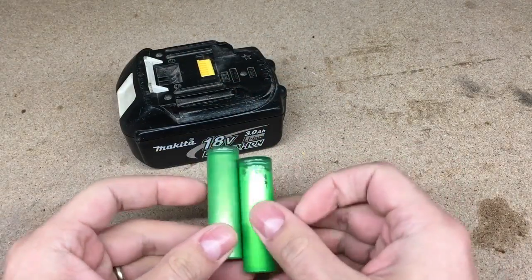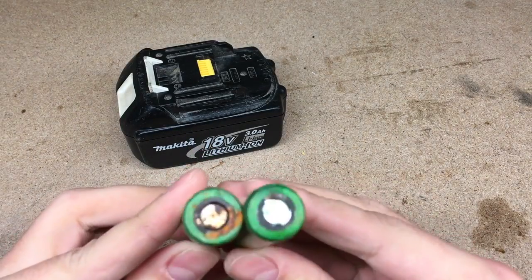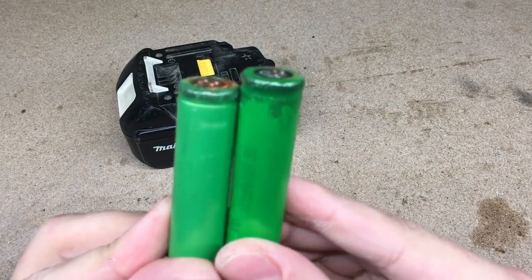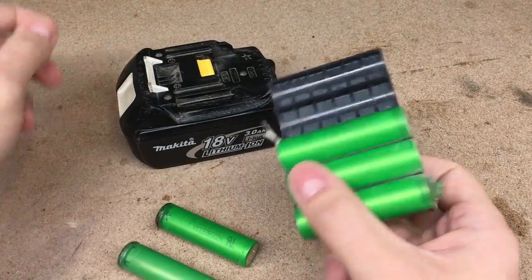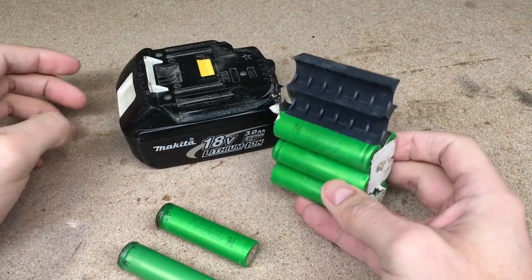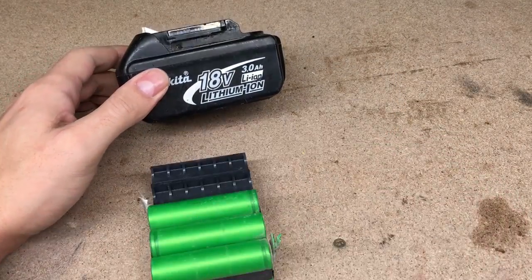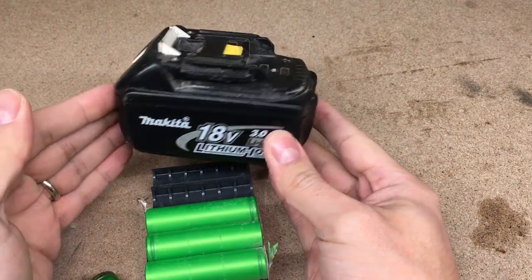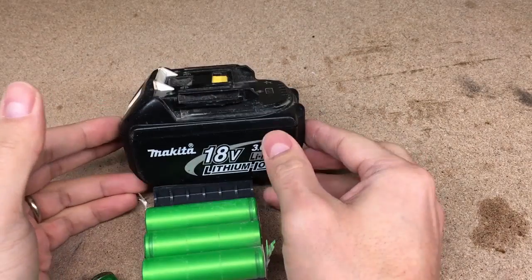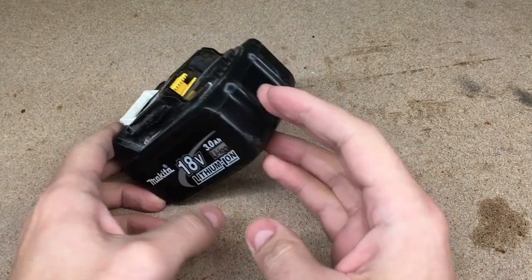In the beginning, I had two dead and useless batteries. By taking out only two dead cells and replacing them with a pair of good cells from a donor, I got one full operating battery and six 18650 cells for future projects. This repair project would be totally free if I stay with the IMAX B6 as a regular charger and get rid of the Makita charger. But I showed you both charging options so you could choose the best solution for yourself.